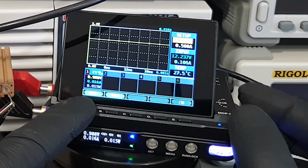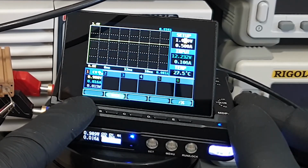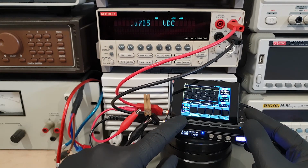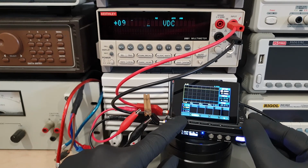Oh, did I mention what an absolutely terrible way of entering numbers this is? It is, and it needs to go. Here's another idea. Take one of those unused push buttons and display "fine" above it. Whenever it is pressed while scrolling, the user can adjust millivolt or milliampere. That's not needed all that often, so when not pressed, you just have a default 1 volt or 100 milliampere programming resolution.